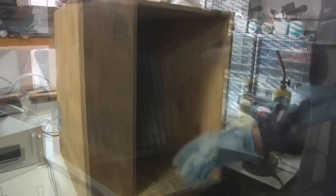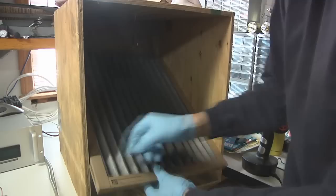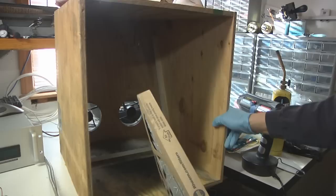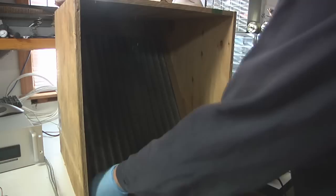And what we're looking at here is actually something that I built. This is sort of my makeshift powder coat booth, and I just knocked it together really fast out of some half-inch plywood and some other scrap wood that I had around. But it's designed to fit a 16 by 20 HVAC filter. And in the back, you'll see that I have a couple of 120 millimeter computer fans running very slow. The idea is that this creates just enough of a pressure inside this box to draw the powder cloud into the filter instead of collecting and drifting out into the room.